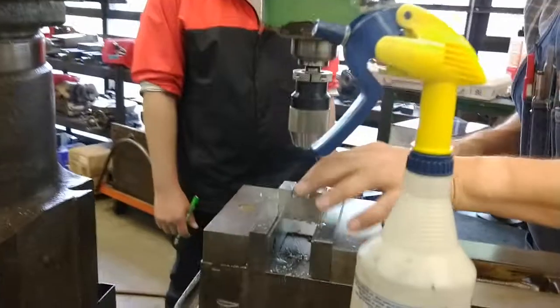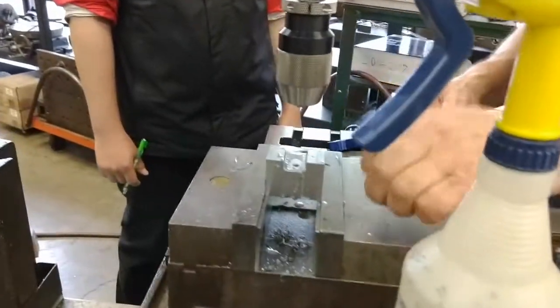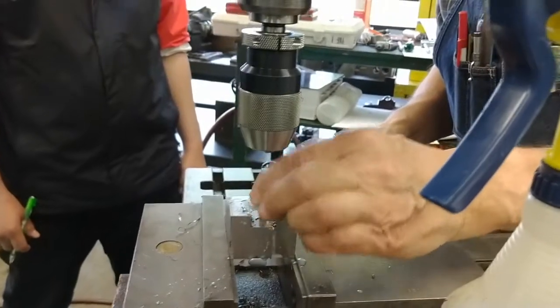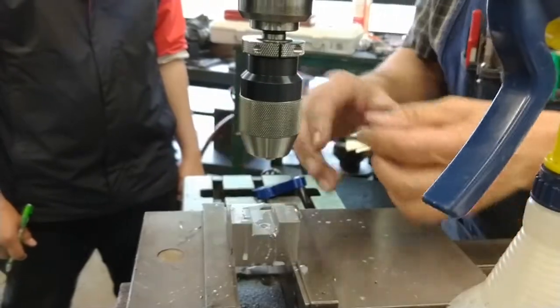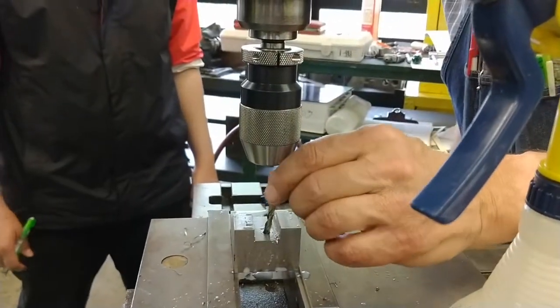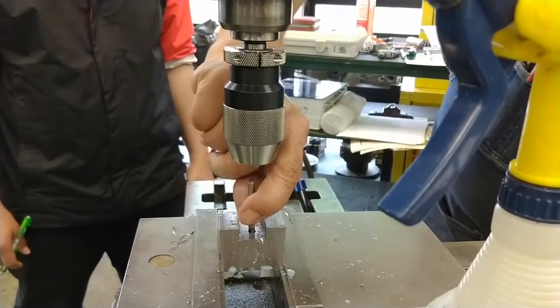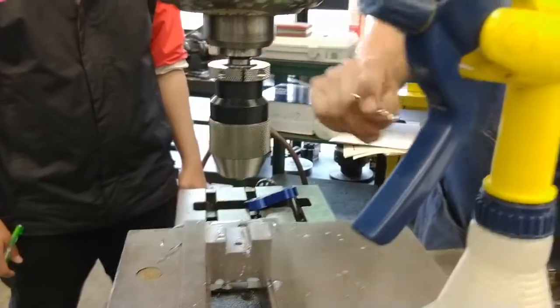Done with the hole, check how deep it is. Simple way to do that: put the drill in the hole, pull any chips out, put it in again, grab it right at the edge of the hole, pull it out, and put a scale on it.